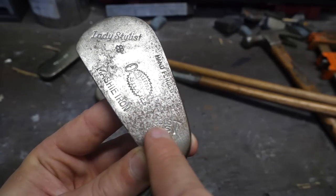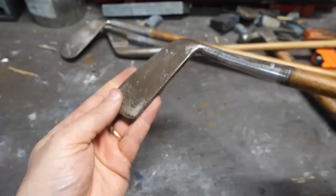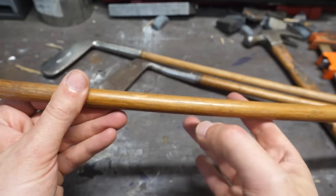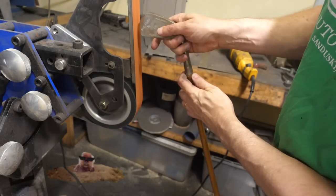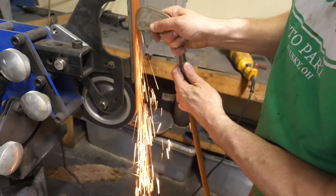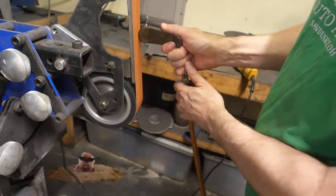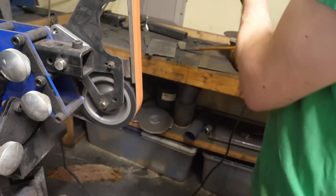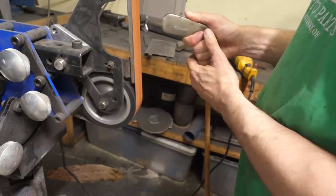Very interesting markings here. If you look closely, you can see right here it says 'D's Putts.' To harden steel enough to be usable as a knife, the steel requires a minimum of 0.4 to 0.5% carbon, and we can sometimes gauge how much carbon is in a steel by checking out its sparks. High carbon steel has a lot of long sparks that flower or burst at the end, whereas low carbon steels have fewer sparks of varying length that don't do much bursting. The first one seems to have a modest amount of carbon, and the other two look like mild steel.